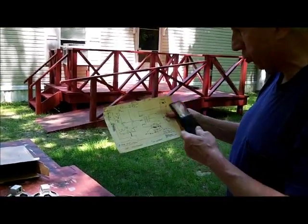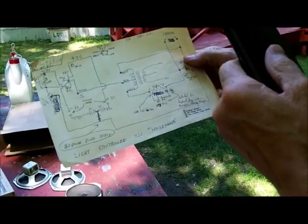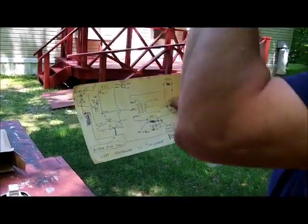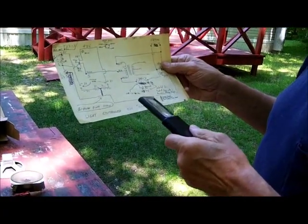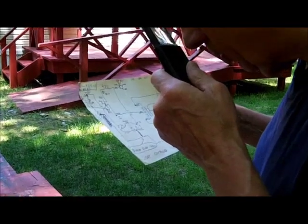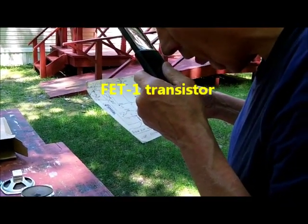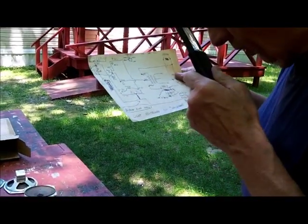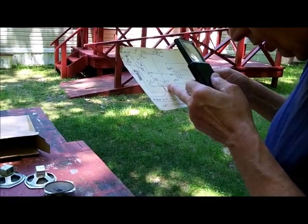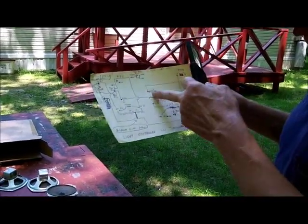This one here is one of my noise makers — a light-controlled noise maker. What would happen is it would squeal on such a frequency that you couldn't tell where it was coming from. It would not go on in the daytime if light was hitting it, but at night with a photocell it would start squealing. The photocell was a GE FET1 or a Motorola HEP 801 — it's been too long. It's a bipolar power supply, three volts center-tapped, six total, with a photocell and a crystal squealer. Here's the oscillator circuit for it.